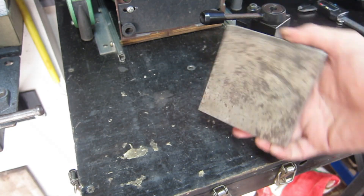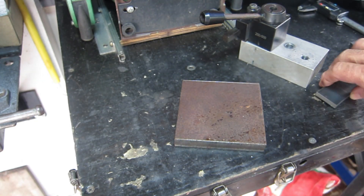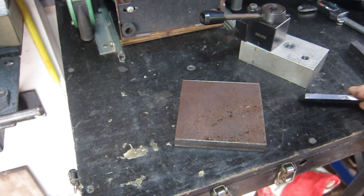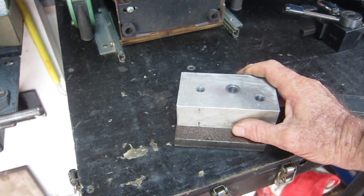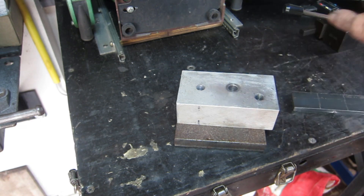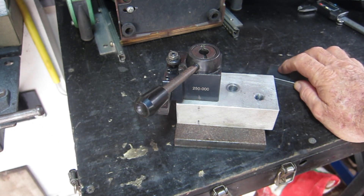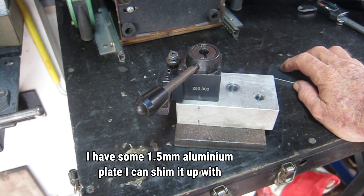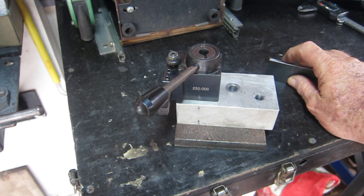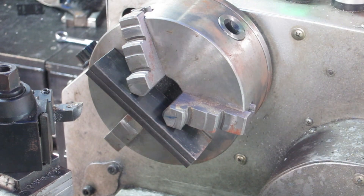I've got this lump of steel here which I'll just lightly fly cut across the top and bottom, and I'll machine a bit of each corner to bolt it down — because that other plate is only about as thick as this, so those studs sticking out are only just long enough to put a nut on. I'll cut some relief in the corners to allow for that. Then I'm going to cut a piece of this up — I was originally just bolting this on top when I was playing around with rigidity problems. I'll use this 10mm bolt hole and bolt it on top. These two combined are about a millimeter or so shy of the height needed to make it a pure swap, so I've got about half a millimeter to face these to get them to exactly the same height, or within maybe 0.1 of a millimeter. This piece I'll bolt up through the bottom so it's fixed onto the plate.